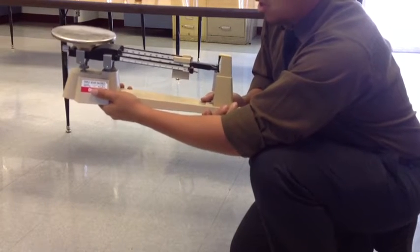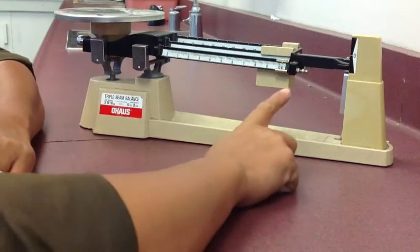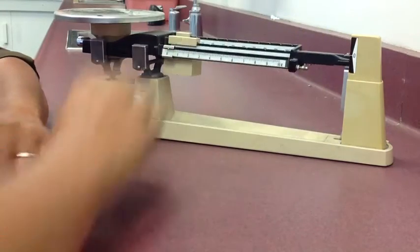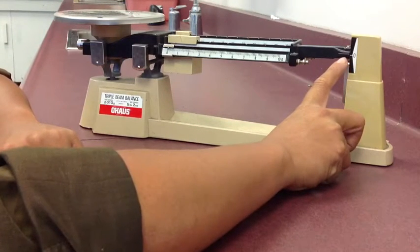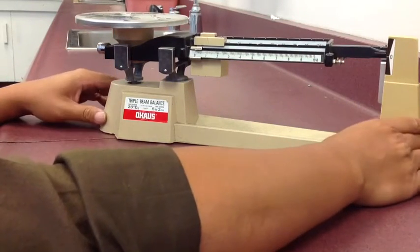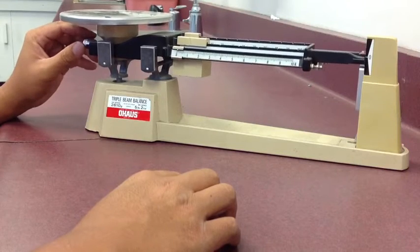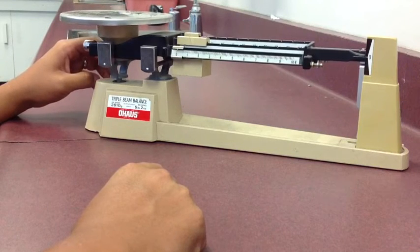Carry it like this. These are very old, and we need to take care of our equipment so we can do labs. Once we have our triple beam balance transported, we need to do a few things. First, move the weights back to zero — there's one, two, three. That's why we call it a triple beam balance: there are three different weights. Once we do that, make sure this line is lined up with zero. There is a knob underneath the plate — adjust that until it's lined up. Twist gently; don't twist too much to the left because it can easily pop off. You need some finesse with it.